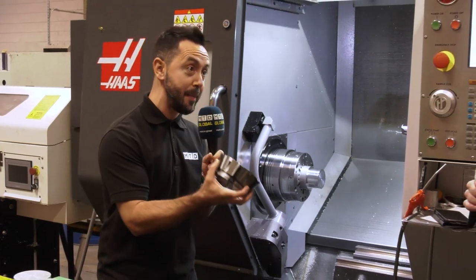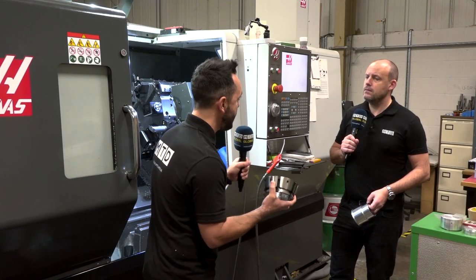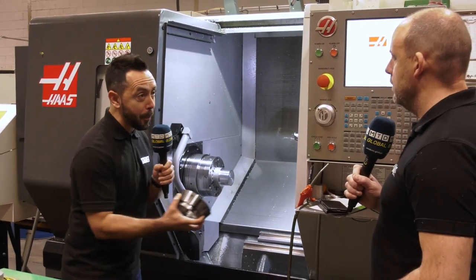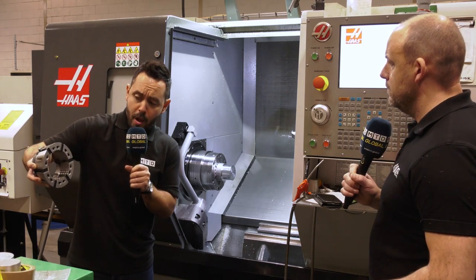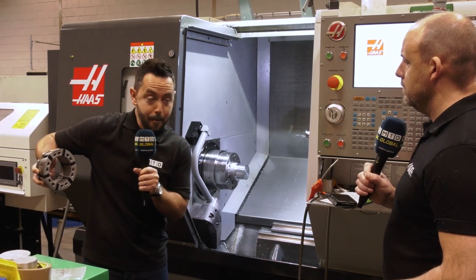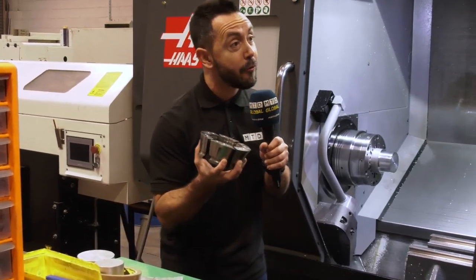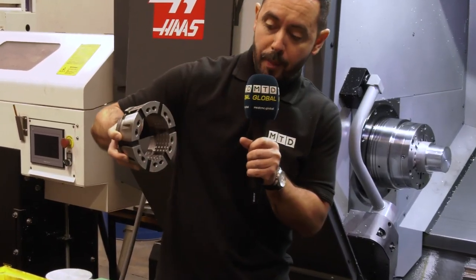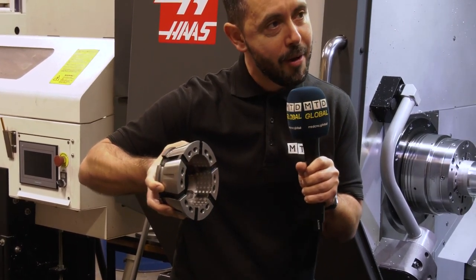If you're changing from one bar diameter to another it's pretty much instantaneous — there's no front plate that you've got to remove. The clamping force is achieved through the collet pulling back, squeezing the bar, and you're getting full wrap-around location not just at the front but all the way through the clamping area.